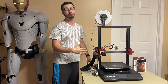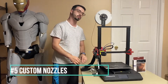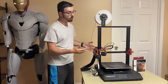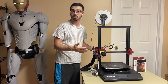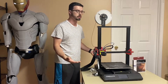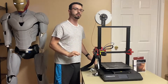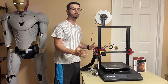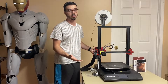I've used this printer for over 2 months now. Coming in at number 5 — I don't feel like this one's a real mod, but nozzle size. You come with a packet of smaller than .4mm nozzle sizes, but what I currently use is a .6 and I would like to use a .8 and a 1mm nozzle potentially. For such a giant printer, it's surprising they didn't include more nozzle sizes, but if you want to really get the best out of your printer, bump up that nozzle size at least to .6mm. You're going to get faster prints, about 20% or so, and you're not going to lose that much definition, especially for big volume prints like this.